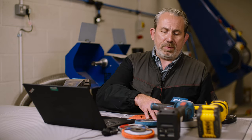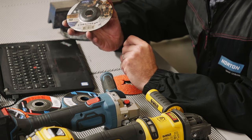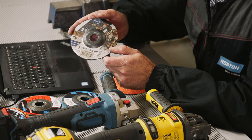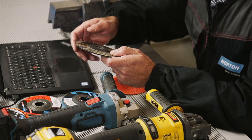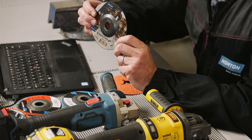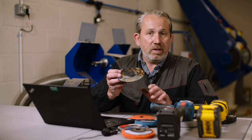For aggressive applications, we recommend our LCG, which is the Light Comfort Grinding disc. Instead of the normal seven millimeter thick grinding disc, this is only three millimeters thick. It will do exactly the same — take off all your welds really easily — but being three millimeters makes it much lighter than our conventional seven millimeter thick grinders, so again saving your battery life.